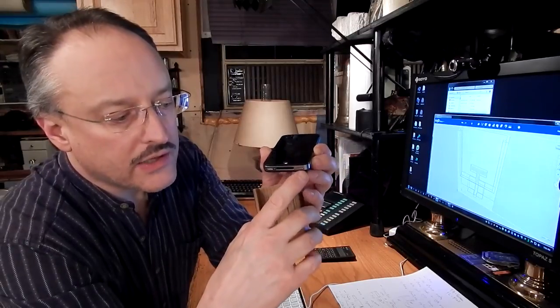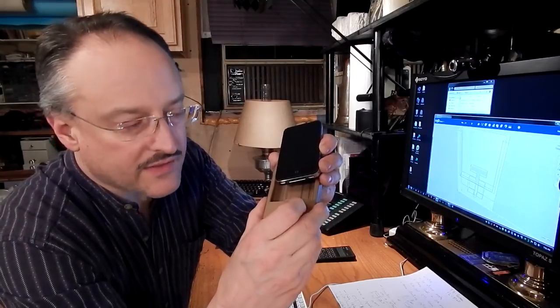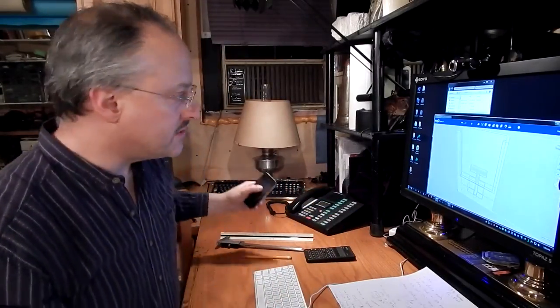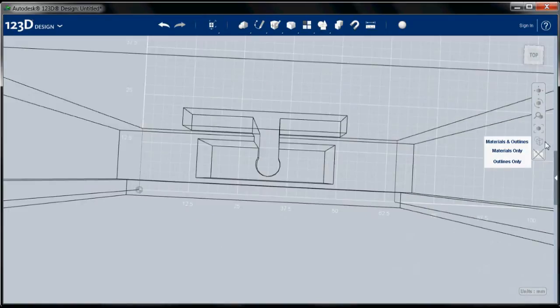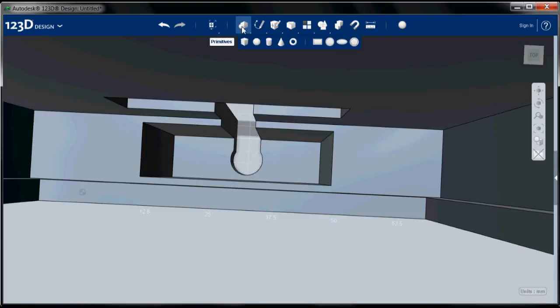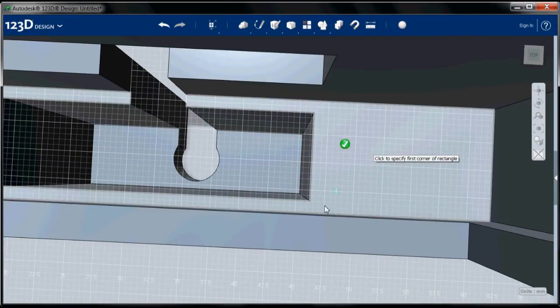So we need some sort of channel in the dock to get to that, so that when it's in the dock, the sound isn't all muffled when we're using the speakerphone. All right, so I'm going to kind of eyeball those because they're not too critical. All right, I am going to go back to this view, and let's turn our materials back on. And I'm going to choose sketch. This is my plane. I'm going to zoom in until I get the finer grid. And these are approximately 2 millimeters in